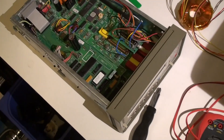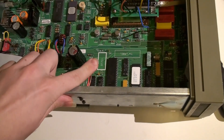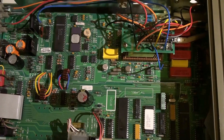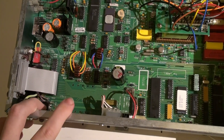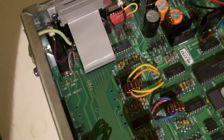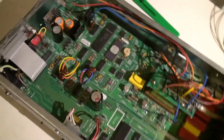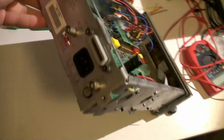I have this HP multimeter with a few problems. One big problem is that the battery is missing — it came loose in shipping, not really my fault. Then there's the transformer: the original transformer I kind of blew up because it was originally set to 100 volts instead of 240, resulting in the transformer blowing up quite quickly.